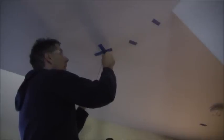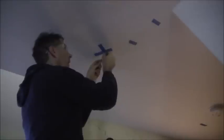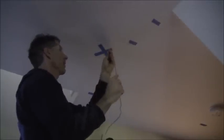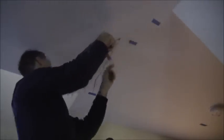Now I'm just going to try to confirm that the studs are exactly where I said they were. I'm going to take this — okay, I'm stopping right there — come back and yes, there's a stud right there. Go back the other way, put a little bend into that so it kind of bends over, and that's stopping right there. So indeed these are my studs. Now I'm just going to verify that I have nothing going on this way.